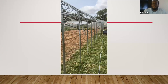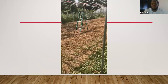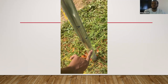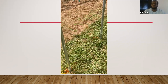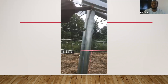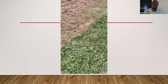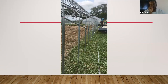And so what we decided to do was the following. So we measure up 7.5 inches, which is a 2x8 nominal. And we make a crow's foot mark, and then we run our string line. And typically what we do is from that 7.5-inch mark, we find the distance to the underside of our hip tracking, and we copy it down there. Well, in that case, that made our baseboard's height 16 inches down there, just because of the slope of the ground. And that just was too much.